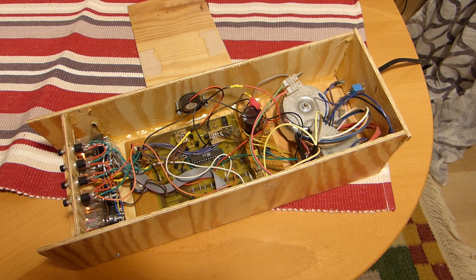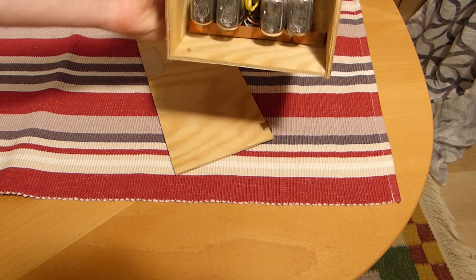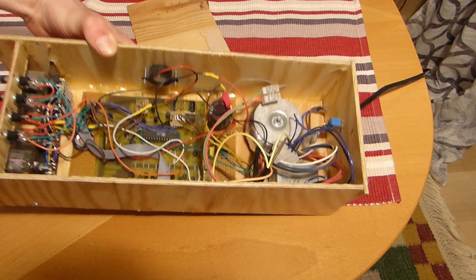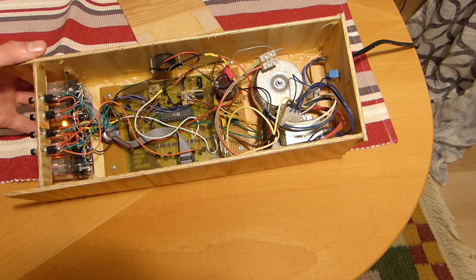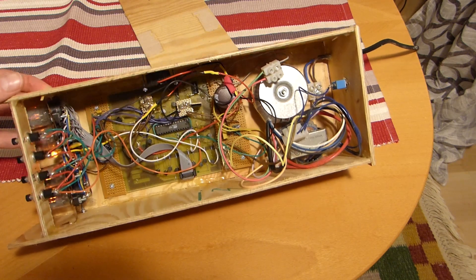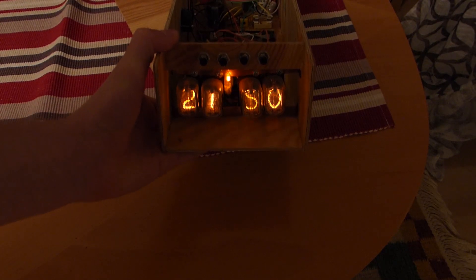Of course during a power cut the digits don't run, but it keeps its time and its alarm setting. Here on the back I built a switch so the high voltage can be turned off — you will see it fade out, yeah it's already fading out — to preserve the lifetime of the Nixies. What's not so nice about this is the cabinet of course. Cabinet making is not my strongest skill and I did not allocate enough time to the design of the cabinet. I never actually used this for long periods unattended because I was always a bit worried about the wood catching fire. Anyway, thanks for watching.